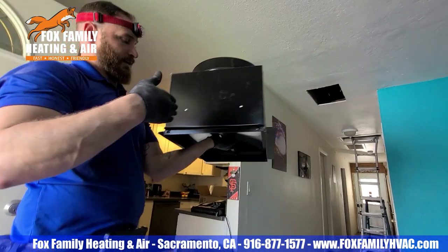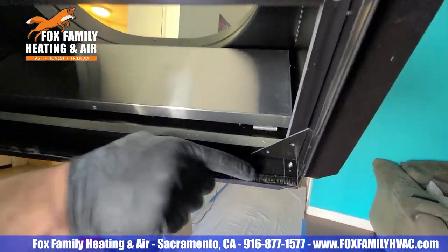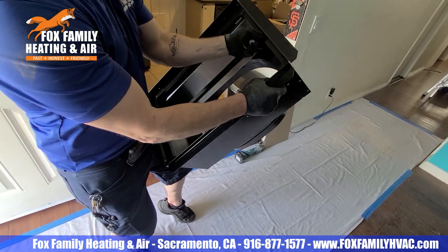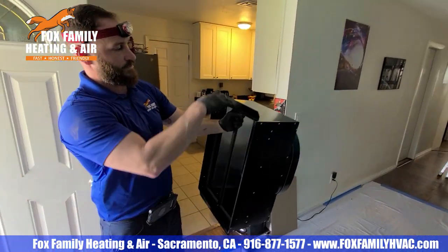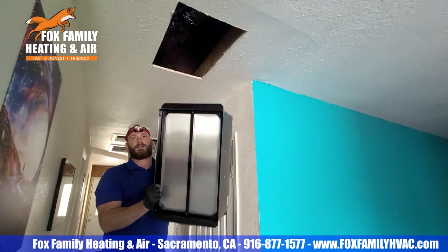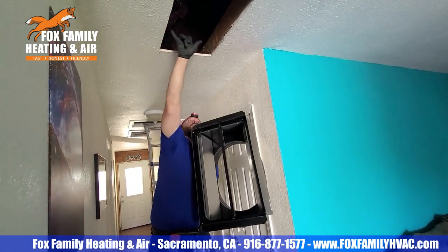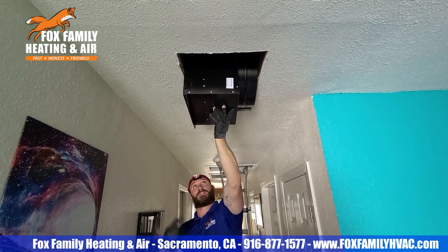In a scenario like this where our framing is right here and right here, you can remove these tabs. If you look in here, it's just a little tab that they've put in there so you just loosen them up — a lot of times you can even do it by hand, but you can grab a screwdriver. Keep these two because there's nothing on that side, so it'll still help sandwich the sheetrock. The helpful thing that QuietCool does is that if you have a really large whole house fan, it's hard to get the stuff up into the attic, especially at the attic access. The attic access is pretty small, but everything they designed is 14 and a quarter inches for the template. Everything is designed to fit through that hole, including if you take the duct off the fan — the fan itself fits up exactly like that as well.